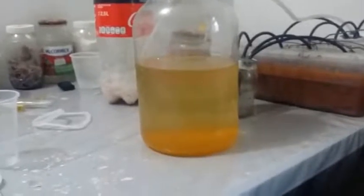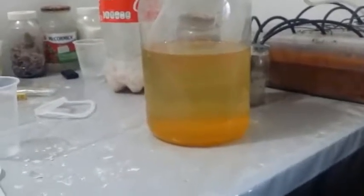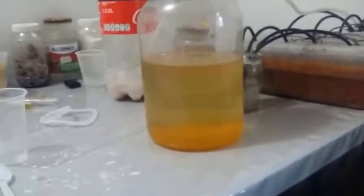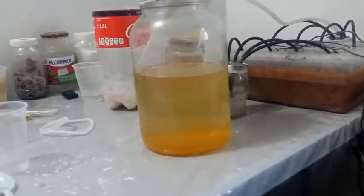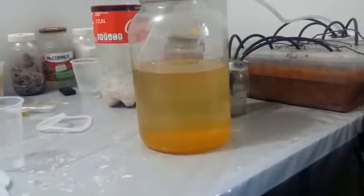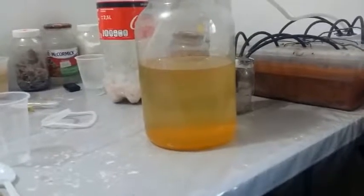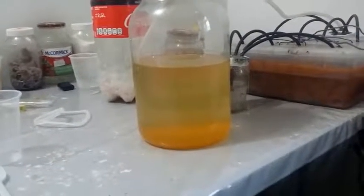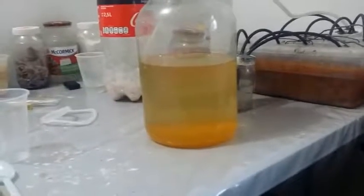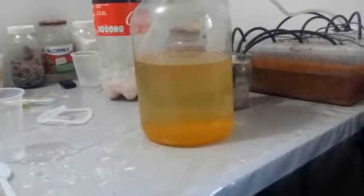When I made a battery from this solution, I immediately noticed more precipitate coming out of it, which made me realize that had happened before. That's what got me started on this and got me thinking that maybe a different approach is necessary or may work better. Maybe I should have right from the start tried making a big cell and just charge and discharge it — I can put a nickel strip in there with a carbon cathode, and as I charge the solution, zinc will plate out onto the nickel strip, and when I discharge it, the zinc will completely dissolve back into the solution.